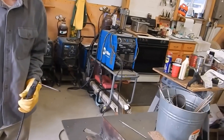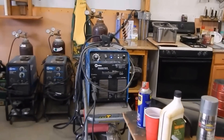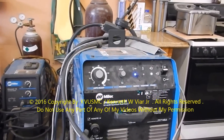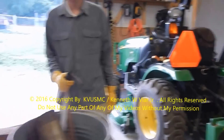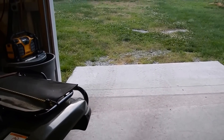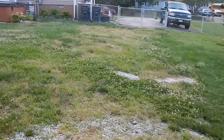I'm gonna show you my meter. When Reese strikes an arc here in a minute, I'm gonna show you with solar power and wind power what my meter will do. That's a 100 amp, 240 volt machine — the Syncrowave 180 SD. We're welding with this machine today. When I give Reese the mark, I'll tell him to strike an arc, and we're gonna see what the meter does — that's 100 amps at 240 volts.